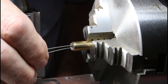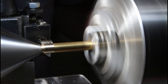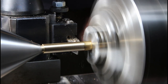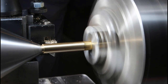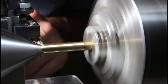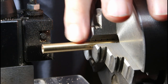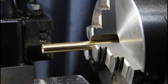Just a drop of CA glue will secure that in there nicely. I'm using my motorized carriage, which is really handy because I can set a stop right before the jaw automatically stops right there, and then I can just reverse it back into a spring pass. I think I need to be running a little faster — automatic stop at this end, right before it hits the center. Before I do the decoration on this surface, I'm going to use my parting tool to make little marks so I know where each of these three sections are. Then I can come back in and decorate them and then part them.